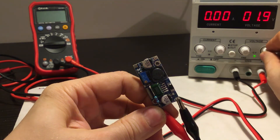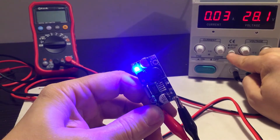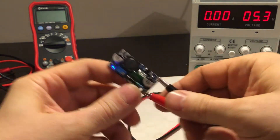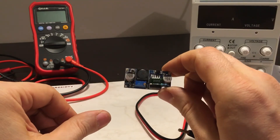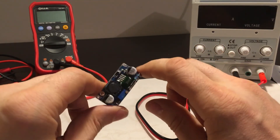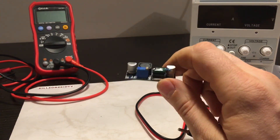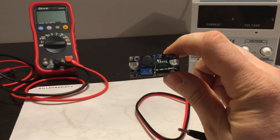The higher the voltage, the longer the delay — and I'm going to operate at about 30 volts, so that's fine for me. That's exactly the effect I'm looking for. If you need this kind of soft start or delayed start, this is one way to go. Pretty nice board, and now I've got a bunch of them — I'm definitely going to use them elsewhere.